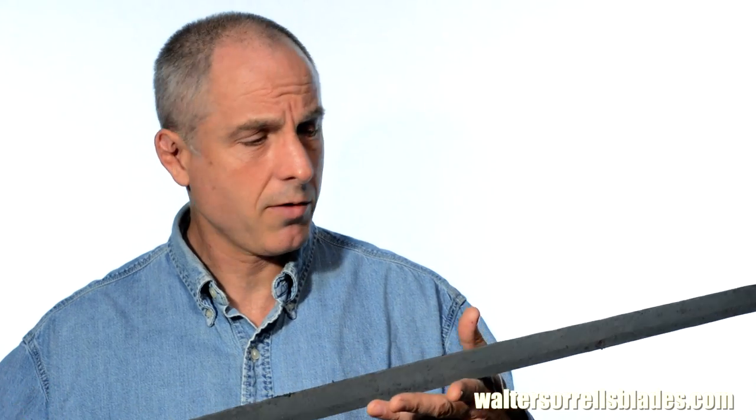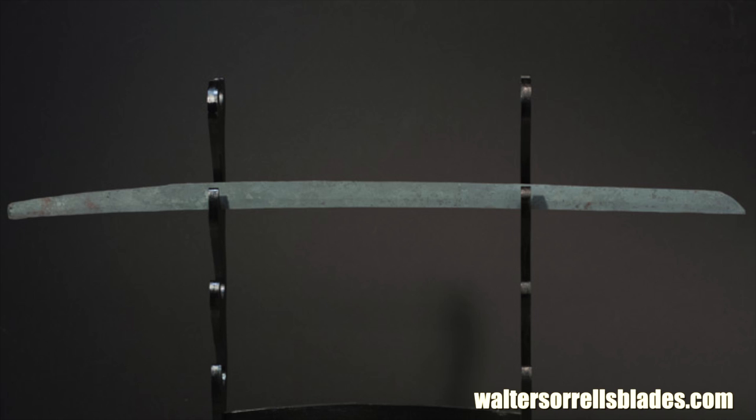What we've got right here is the final result. One of the interesting things about Japanese swords is that the differential hardening process — also known as clay hardening — causes the sword to bend in the course of the quench. It really happens in about three or four seconds; it's an amazing thing to watch. But from a smith's perspective, it's kind of frustrating because you can never predict exactly how that curvature is going to work. All you can do is, based on your experience, give a rough guesstimate of where it's going to go. So when you look at this blade, you're actually not seeing what its final shape is going to be — you're seeing my guess as to what I have to do now in order to have it preformed so that once it makes that curve in the quench, I get something that has a pleasing curvature.